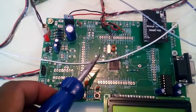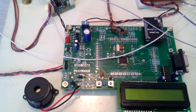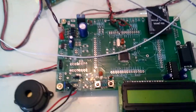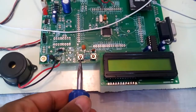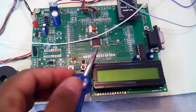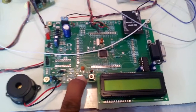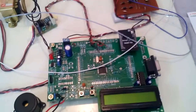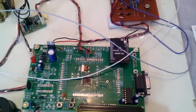I am using a 12 MHz crystal, which is the heart of the circuit for the controller. It generates clock pulses to the internal CPU to run the program. I am also using two push buttons: one for ISP and another for reset. When we want to dump the program onto the microcontroller, we have to press ISP — In-System Programming. We press and release reset, then the program will be dumped using UART 0 in ISP mode.